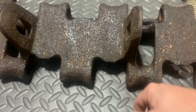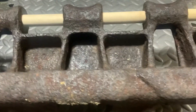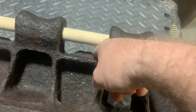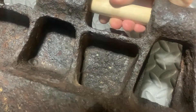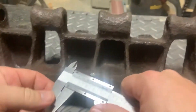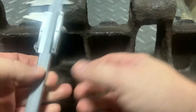You can actually see some little wear patches where the wheels were. I stuck a wooden rod in here to simulate where the track pin was, because these features — I had first thought were casting leftovers — are not. You can see, as I turn my hand here to simulate the knuckle of the next track, they're clearly some kind of cast-in scraper for mud and/or ice, which I had no idea about. A very clever little feature.